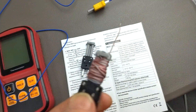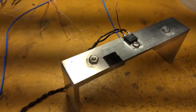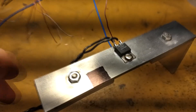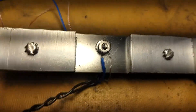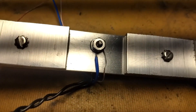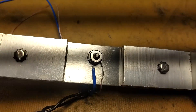Here's the test setup we're going to use to test our thermocouple meter. That's a power resistor attached to a small heat sink. Under the washer that's under the nut, we can see the blue thermocouple wire that comes with the meter. And there's the red and white type J thermocouple that I'm going to compare it to.